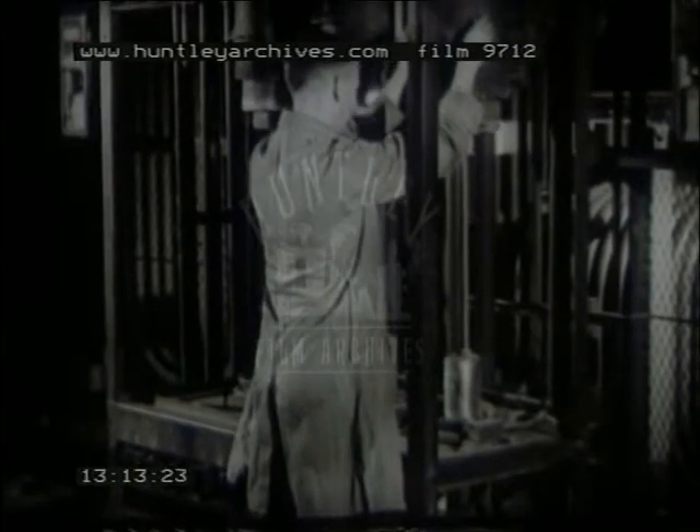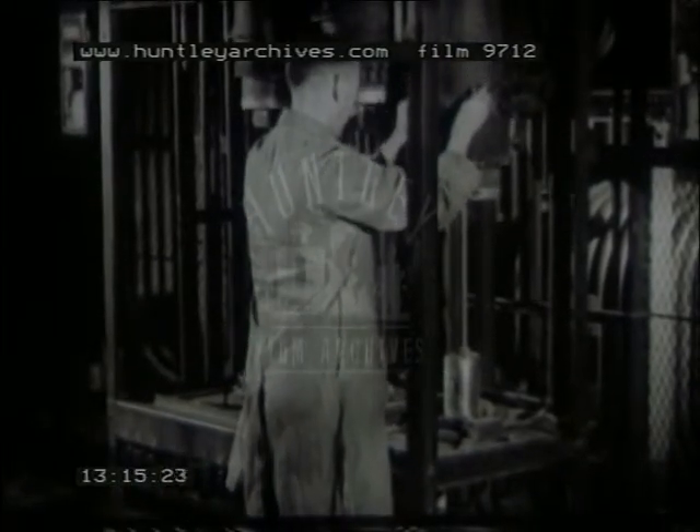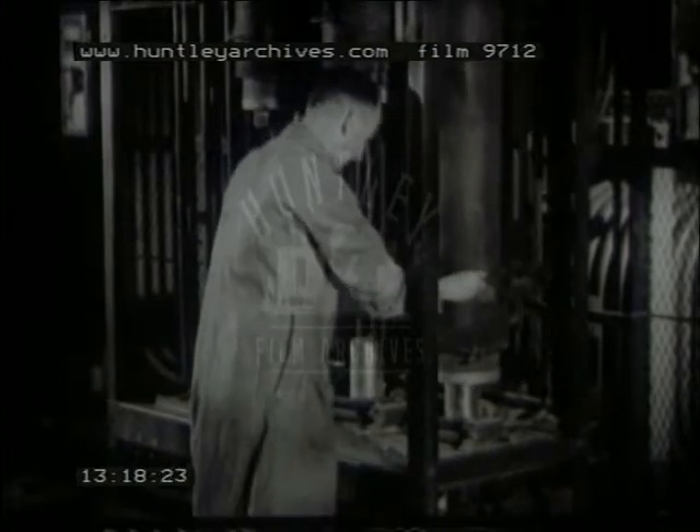So the bar is now sintered — it is heated to a very high temperature by enclosing it in an atmosphere of hydrogen and passing an electric current of between 2,000 and 3,000 amperes through the metal, obtaining a temperature of 2,700 degrees centigrade. The tungsten now has a crystalline structure. The first process in wire making is swaging — that is, hammering the bar so that it becomes thinner and longer.